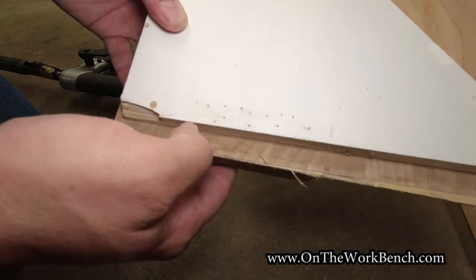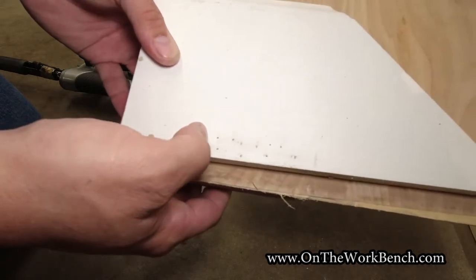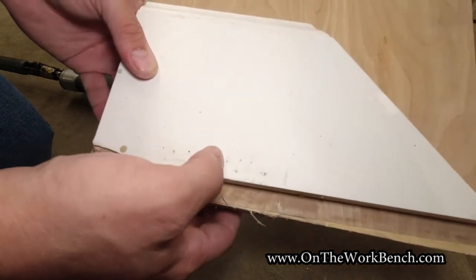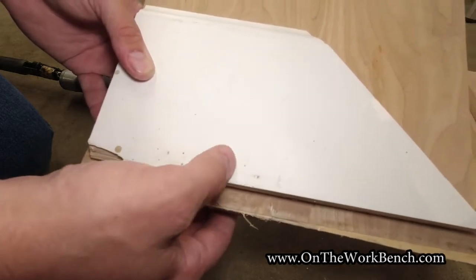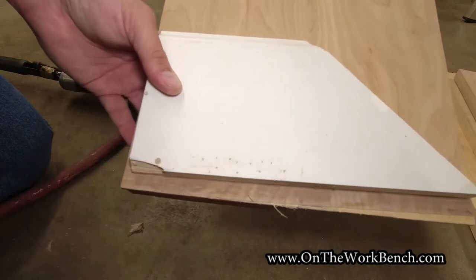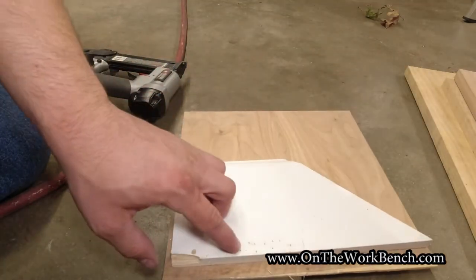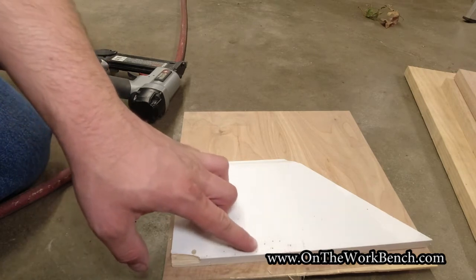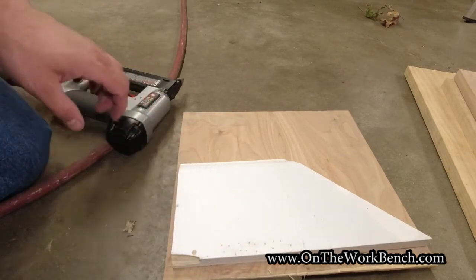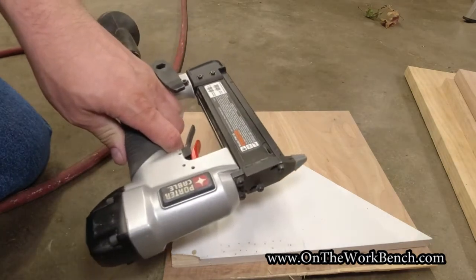And so it looks like this is sinking them just slightly flush. There appears to be a little bit of red on the top, which I think might be from the actual nail sets themselves rather than from the tool, which would be, in all fairness to the one shot with the Arrow, might be able to rub off a little bit here, but it looks like these are working just fine with the Porter Cable. So it looks like you might have some options for which size you want to use. I'm not sure if this is recommended for the Porter Cable, but at least as a proof of concept, it does work. And this is probably fine for a few shots. I don't know if I'd want to go all day on the Porter Cable with those 10mm nails. From that 60 psi it's off, you might need to back that down just a little bit farther at 10mm or 3/8 to get that to work. But I think that's definitely a viable alternative.